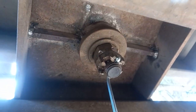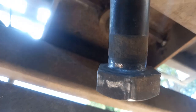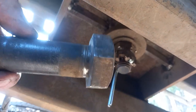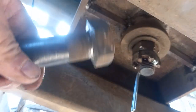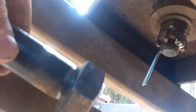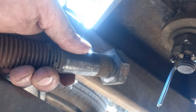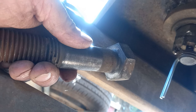I put some stiffening rods across the frame. It's been two years so I decided to replace the main bolt. This is the original bolt that came out — it's an M30 by 150 bolt with a breaking strain of 40 ton. What I was interested in was the wear around the top, and as you can see it's nothing substantial.